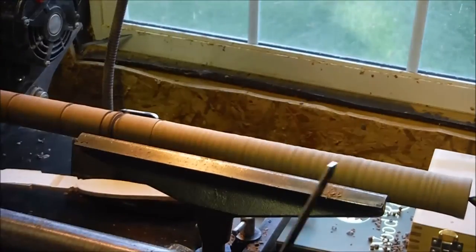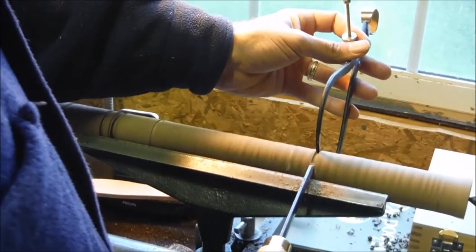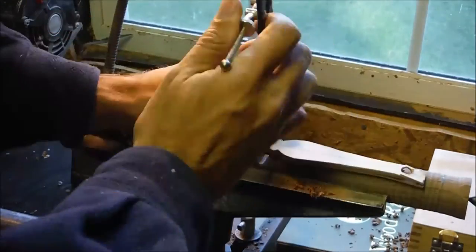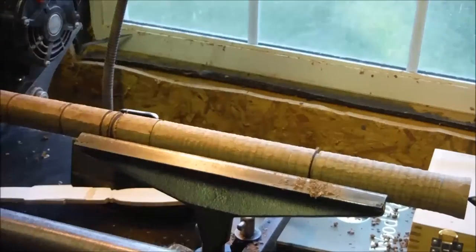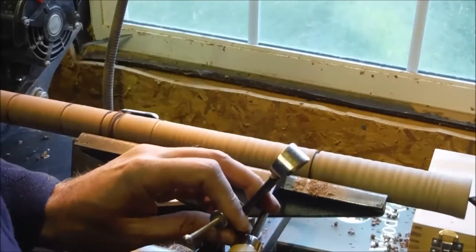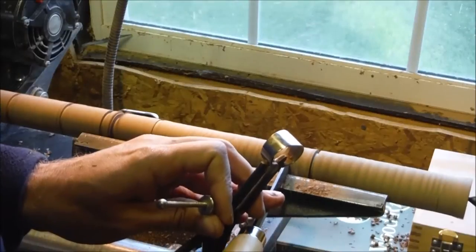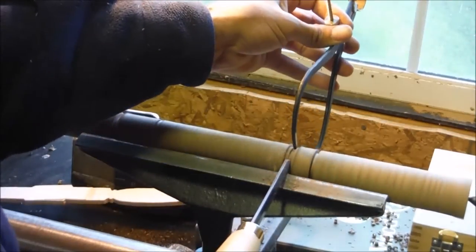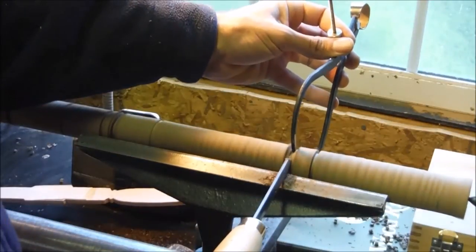I could probably do a little bit more. The tips of the calipers should be good and round with no sharp edges — otherwise they'll chatter like crazy while you're turning. It doesn't hurt to go over the tips of those calipers with steel wool or even a file.